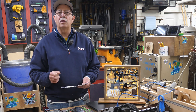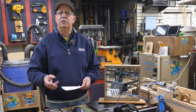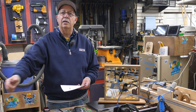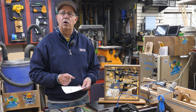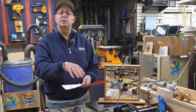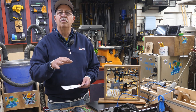I hope that answers some of your questions about which laser to get and which is best for you. Again, it depends on your project. If you're going to be making big wood signs, you may want a laser with a larger format or get an extension kit. You don't necessarily need a 20 watt head if you're engraving on wood or powder-coated aluminum, but it'll go a lot quicker. Another thing you can do with a 20 watt that you can't do with the 5 or 10 watt: when etching stainless steel, depending on your power setting, you can make that etching different colors — that'll be a video coming up in the future.